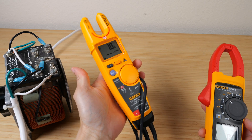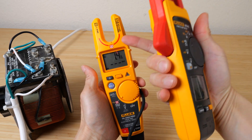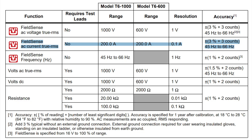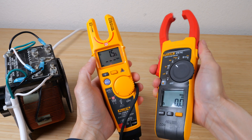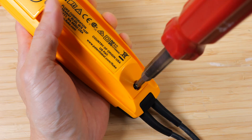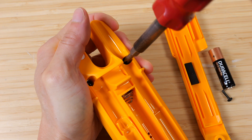Overall, this is useless if you're trying to measure DC amps. For AC amps, this is very good for electricians, as long as you don't care if the amperage measurement is plus or minus 10% or so. If you want more accurate measurements, I still think you should get a clamp meter. To change the battery, there's just one screw. It uses two AA batteries.